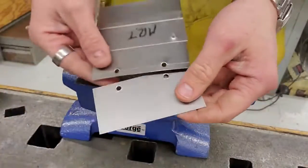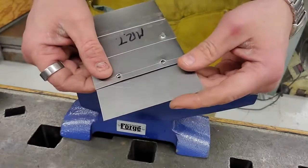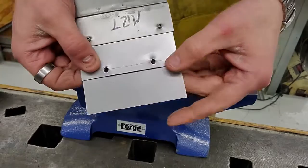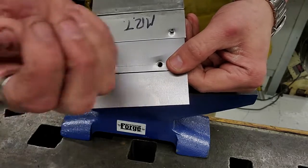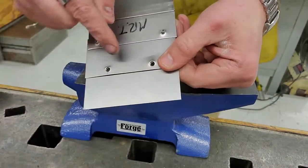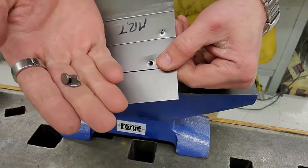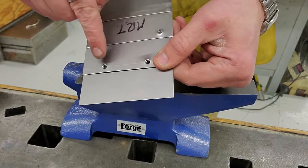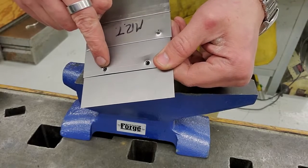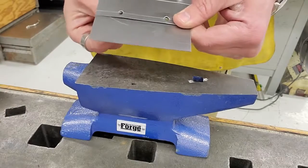With this step we don't have any clecos — you're just going to bring this up to me, set it over like this, show it to me, and if I think it looks good I will give you two rivets. Now if one of these doesn't line up, I'm probably still going to give you rivets and tell you to install one rivet and re-punch the other hole at the turret punch — then your other rivet should fit. Mine look like they line up pretty good.